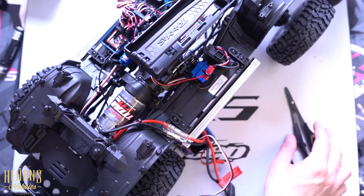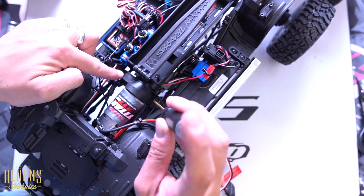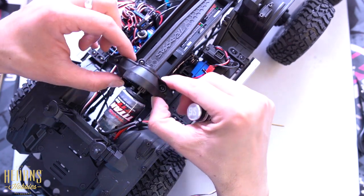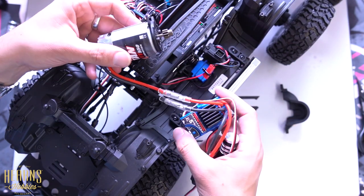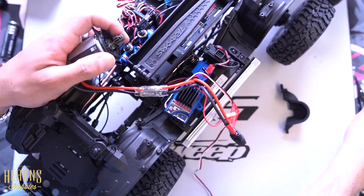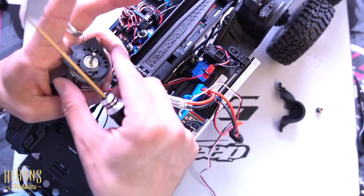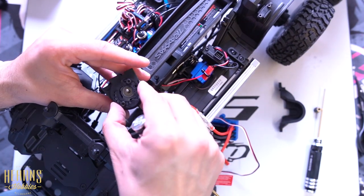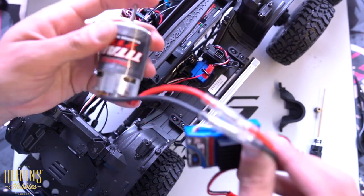The next step is to remove the motor. To remove the motor you need to undo three screws with the 2 millimeter hex — that's all you need. With three screws out, this part is going to come out. Now with a 1.5 millimeter hex, we're going to remove the pinion — park it here for a second — then we're going to remove the motor mount. It should all fit back in the same position, so note the orientation: there's a 'C' here and the third hole on top, so keep that in mind.